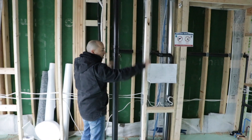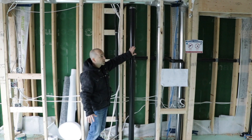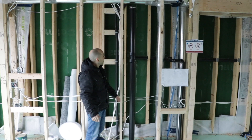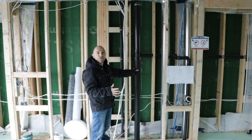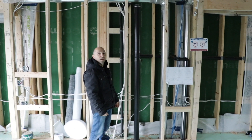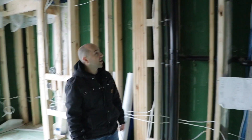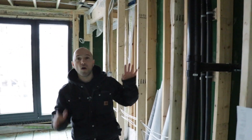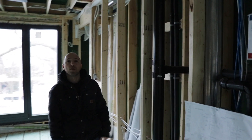What we've had to do is come down here and split across all the venting all across the wall, and from that point feed every plumbing fixture. It was tricky, but we love pushing the boundaries of what we do. This house is going to be very airtight, so we want to minimize all the penetrations in how we're designing the plumbing system.